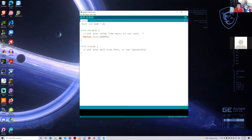I'm going to do Serial.begin(9600) and then pinMode(led, OUTPUT). Then digitalWrite(led, LOW). Outputs can be LEDs, motor signals, or outputs to a transistor for a voltage leveler. Inputs can be sensors — ultrasonic sensors, temperature sensors, pressure sensors, LiDAR sensors. Any type of sensor that feeds data into the Arduino is called an input. I'll also do Serial.println('Finished setting up code') — if I see this in the serial monitor, I know the Arduino has finished setting up and I can move on.